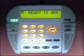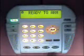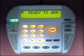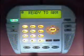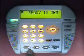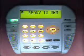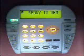On the keypad we have six programmable function keys: F1, F2, F3, F4, F5, and F6. These can be programmed from the keypad or from ELK RP programming. In the default mode, F1 is fire, F2 is police, and F3 is programmed as medical. They are programmed for two presses to activate their defined function.